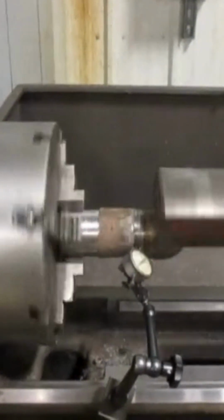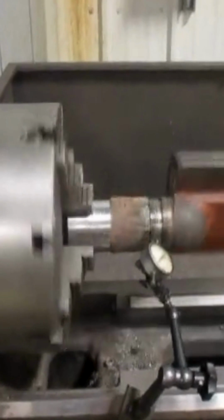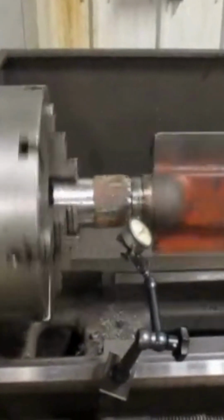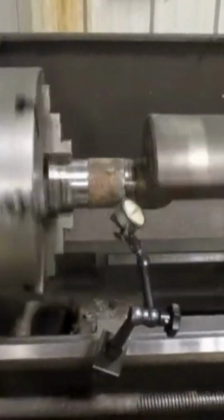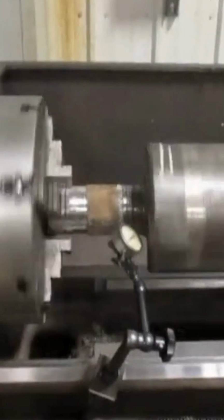The frame of the shaker system. So the bearing diameters on the shaft got worn down, undersized, way worn down, and the guy was having failures. He tried to just put new bearings in and do some welding or a lot of different little things that people think they can get away with to make things go, but it turned out the thing would not go. So we're doing a complete repair on the shaft. We're making 2 new bearing retainers, and we're fixing the frame plates.